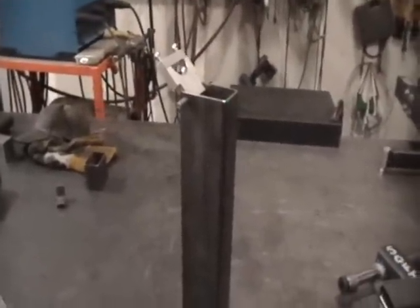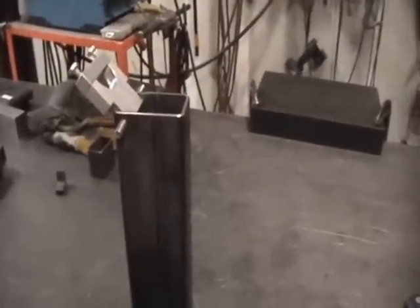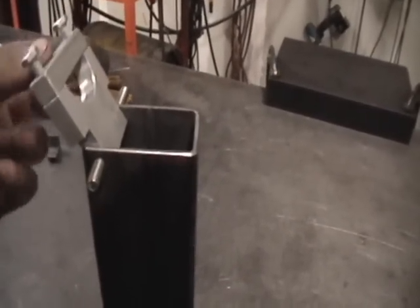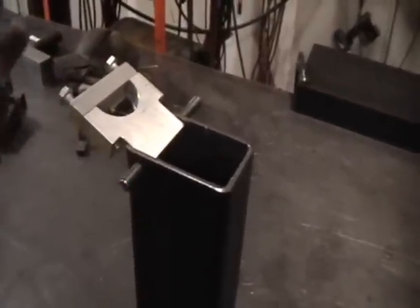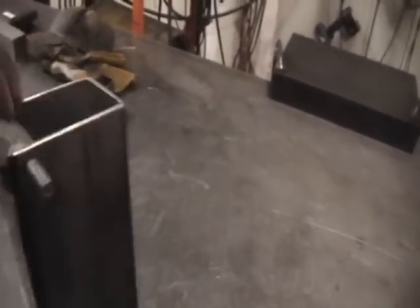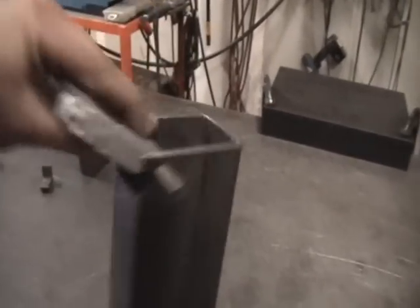Here's another small piece — a holder fixture for a single down tube. If you were going to do a single down tube in the front of your frame, this is one of the pieces you would use. It's got a piece of 2x3 rectangular tubing, 18 inches long, with a hole up in the top which acts as a pivot for this clamp — an inch-and-a-half diameter clamp. It's just a little aluminum piece tapped with some bolt holes, and it rotates on a pivot. Once you find out what angle your down tube is going to be, it will basically adjust to that. The front is notched out just for clearance so this thing can rotate however it needs to go.